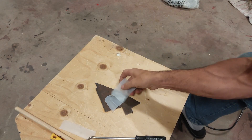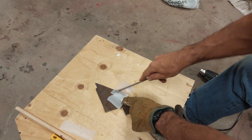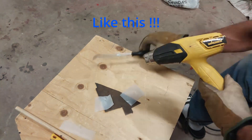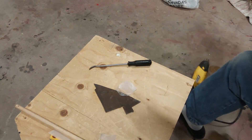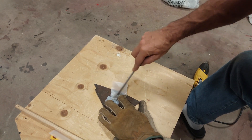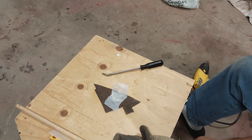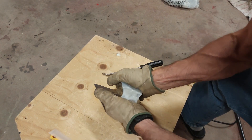If a piece isn't quite hot enough and you take another piece that's cold and press those together, nothing happens — they do not stick. As you can see, the piece had gone clear and was curling up, so hot and cold don't stick together. But when both pieces are hot, you can see they stick together.